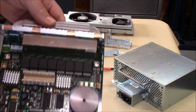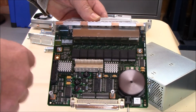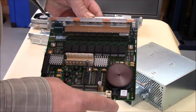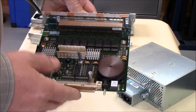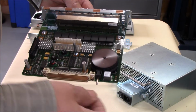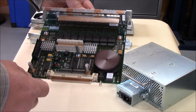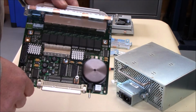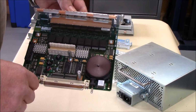And I was looking at the board just briefly, and I'm not going to analyze this. That's Dave's job. But it does have this right here. This is, I believe, a ground pin, which makes me think this module is hot swappable. We'll have to look at that, because usually on hot swappable modules, they have the ground inserted first, so static electricity doesn't zap anything. But we'll have to check. Never second guess these network modules. If you can power the thing off without causing an outage, do it. It's just a lot safer.